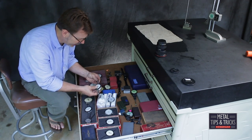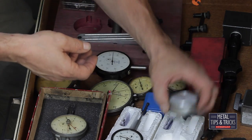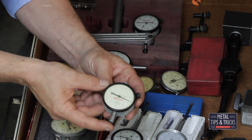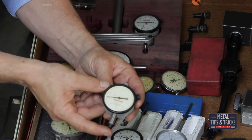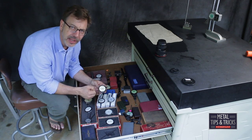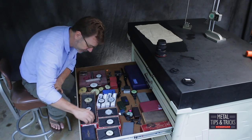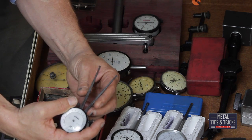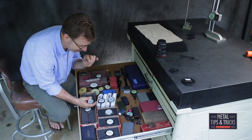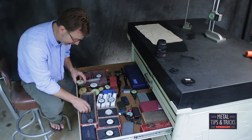Here's a two-inch Starrett, and this is also a two-inch but cheap. Here's a beautiful little Starrett with very short travel, accurate to ten-thousandths of an inch — just feels really nice. One thing to remember about any indicator is spring quality is really important when working on measurements at ten-thousandths of an inch, because if it's pushing too hard against the part it might deflect it out of position — something to be aware of. Here's another dial indicator for measuring inside diameters — tricky tool, you have to get calibrated to it. Still struggling with using it. Here's a Starrett with what looks like about three inches of travel.